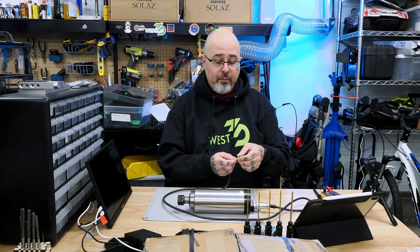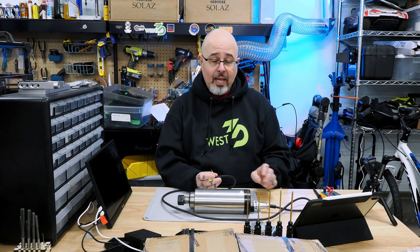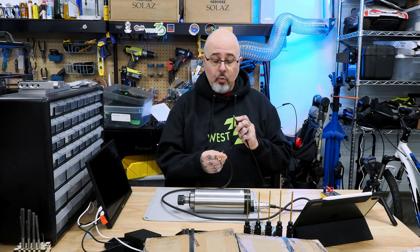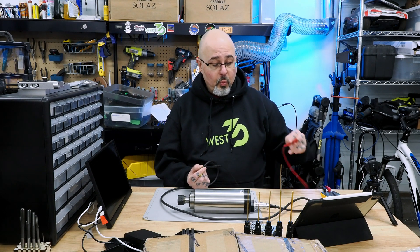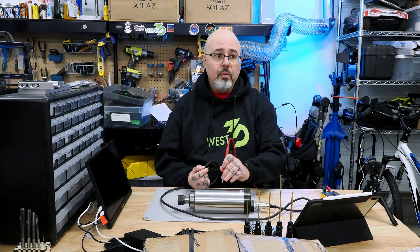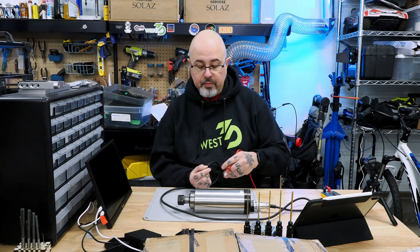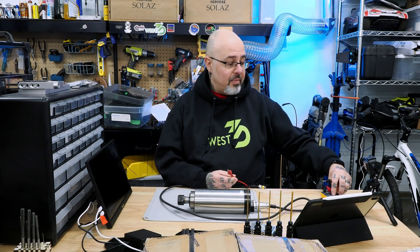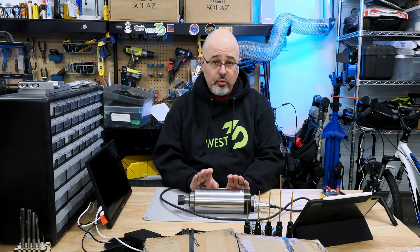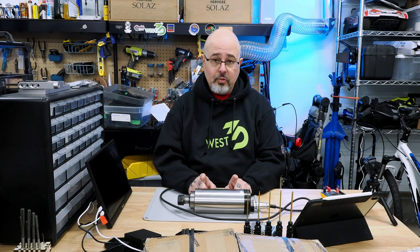What you need to do is find on your wire and connect to the PE, or physical earth, pin. If you don't have the cabling installed yet, you're going to test pin four of the standardized aircraft connector. What you want is: if you connect one lead to physical earth and touch the body of the spindle, you should hear a continuity beep — and I've got it even at the collet and the motor spindle itself. If you don't hear that, your spindle is not grounded. If there was a short, there could be line voltage at 110 or 220V present on the biggest piece of metal that has power that you could touch, which is not a good thing.